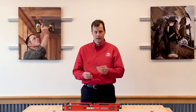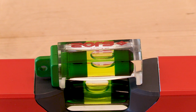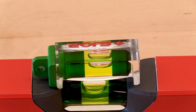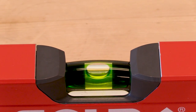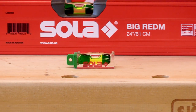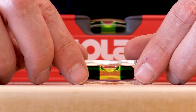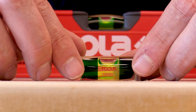What we've got here — and we'll zoom in on it — is one of their focus vials. They've got a square edge on this, which some of their competitors have. And you can see, if you get in the right area, that you actually see two bubbles — one from this plane and one from the top plane. By having a true round vial, the Sola focus vial is a single bubble, no matter where you look at it. And because of the geometry of the vial, they're actually giving you a 60% magnification on that bubble. The bubble isn't any larger than their competitors', but it appears larger.